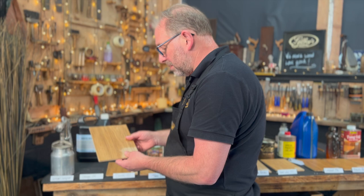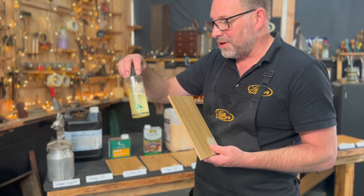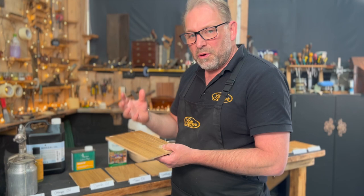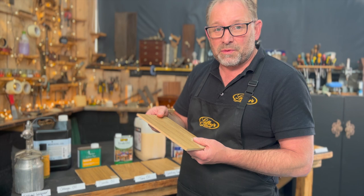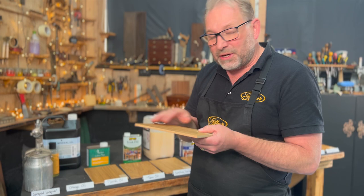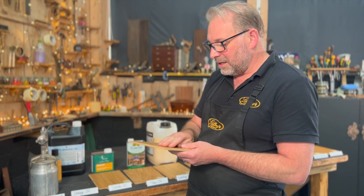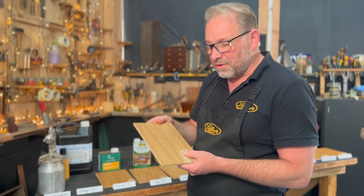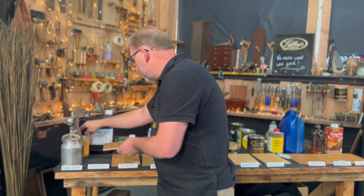You often hear about mineral oil and oil-based polishes — I've seen this many times on YouTube, especially in America, people using oil-based wax polishes for their furniture. Don't do it. You're putting oil onto pre-finished furniture — it's going to do no good. If the finish is degraded and there are areas where the oil can creep in underneath, you're in big trouble. Mineral oil is just a carrier and it's not a finish at all. It's a non-drying oil.